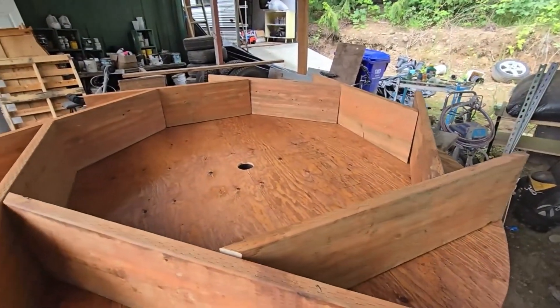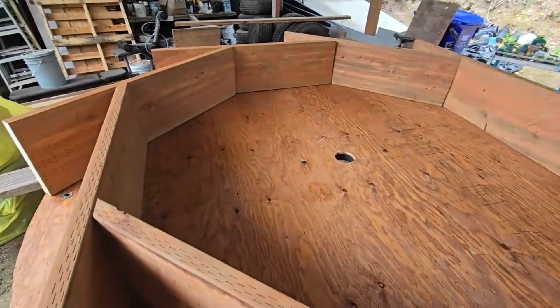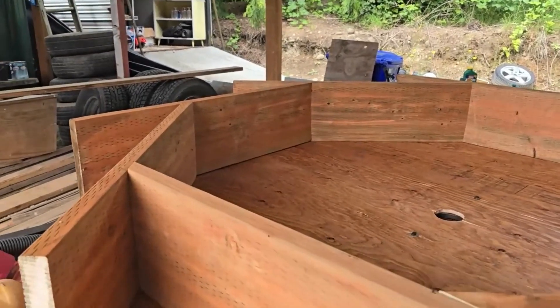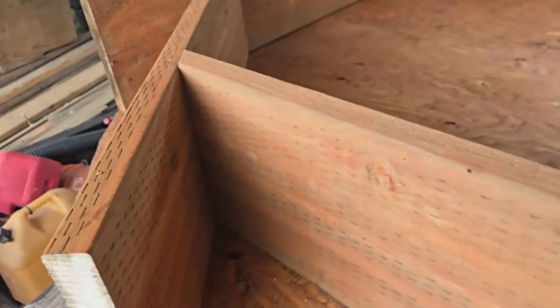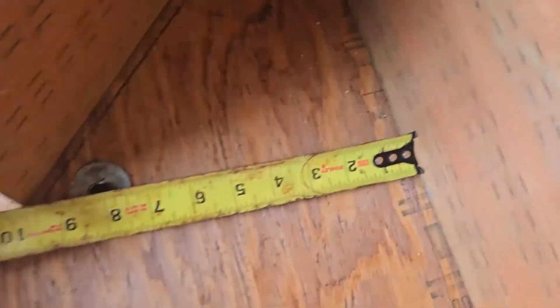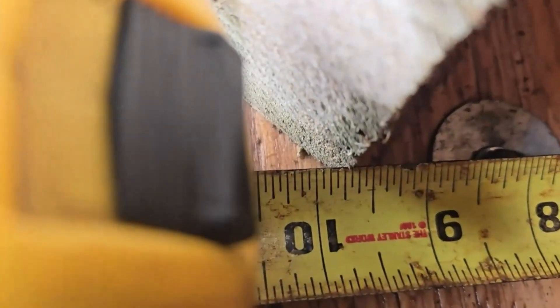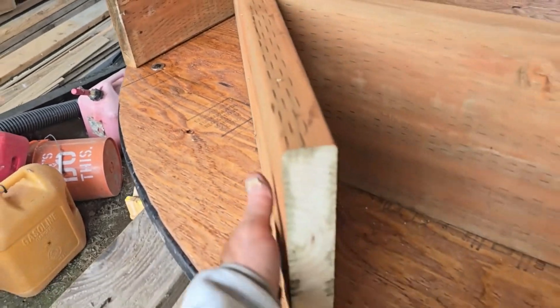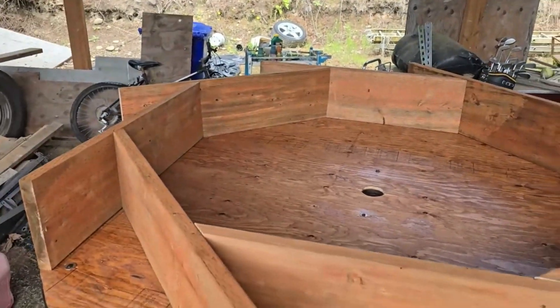I fastened them together and shot one screw up through the bottom piece. The best way I found: outline all your stuff, make your marks on top, but measure a straight 45 across — straight 90 off the board. For me that measurement is nine-and-three-quarters to this point, and I made them all the same. I also put one screw here so I could adjust them individually without the whole thing moving. That's eight of them — two-by-twelve PT.